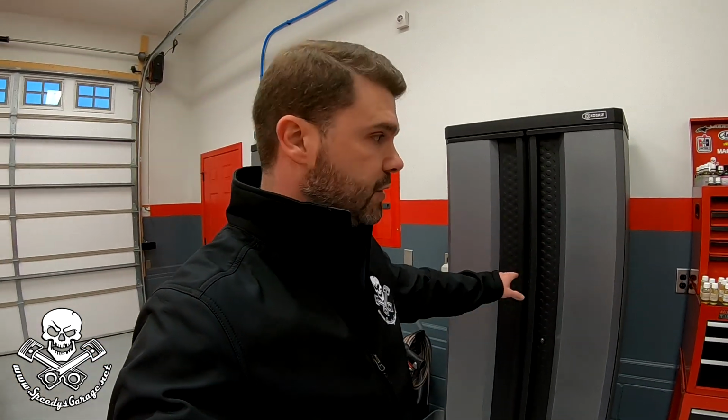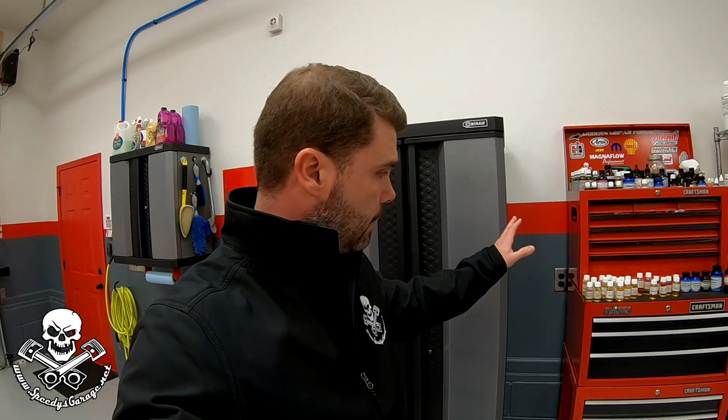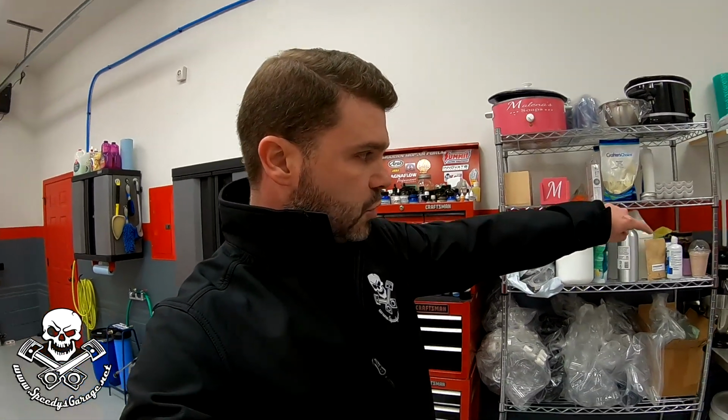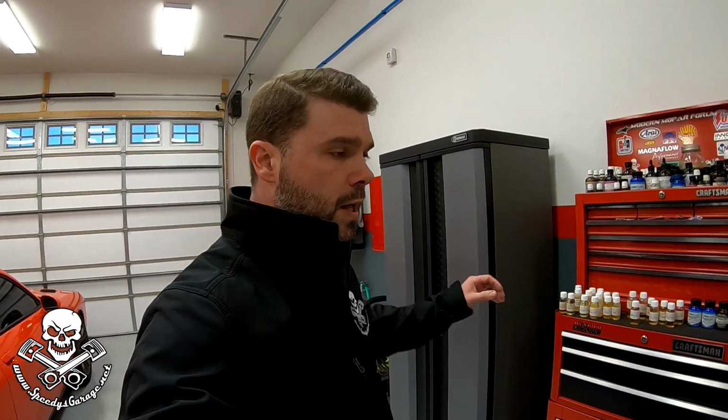Now, one thing I had to also consider is that those PEX lines run literally against the outside wall. So they got insulation around them because the insulation came in and went on top of them, but they're just in that cavity, and they basically drilled through all the 2x6s to make room for those PEX pipes to run through. And PEX is just that red and blue plastic. It's got a pretty high burst strength, so if it freezes, it's supposed to be able to resist some of that, but I didn't want to take any chances.